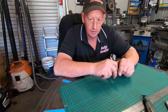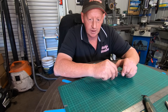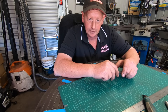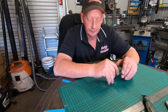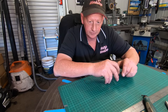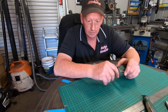It did have a lot of crankcase pressure — it was blowing out the vent pretty bad, which is why I had that green rag under there. But it seemed to slow down a bit and it's got a fair bit of compression there, which is good. I'm absolutely knackered to be honest. I'm happy that it's going — that engine would be good enough to go up to the rally and be running for the day, and I've got full confidence it won't give any trouble. It's not quite running 100% smooth, but I'm going to get old mate Jacko around here and get him to have a fiddle with it — I reckon he'll get it running Mickey Mouse.